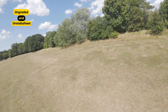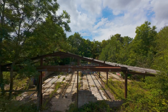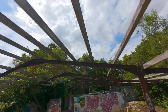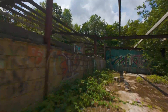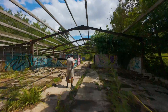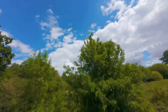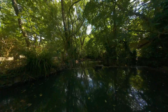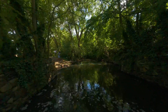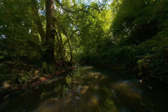Overall, with the recommended 3S 550mAh battery that I've been using, I've been getting anywhere from four minutes with aggressive high-throttle punch-out type freestyle flying, to five minutes with fast forward flying at a camera angle of 30 degrees-plus with more consistent throttle and fewer punch-outs, and even up to over six minutes with much slower, more chilled cinematic flying at a camera angle of five to ten degrees — cruising very slowly indoors or in between trees in a forest. That's pretty good for a drone of this size.